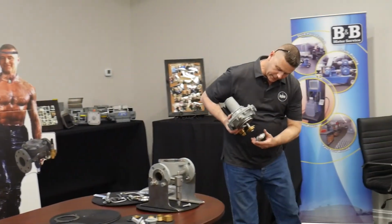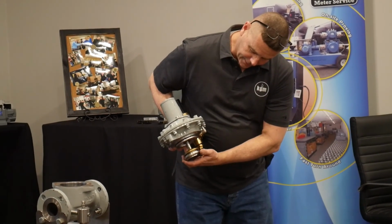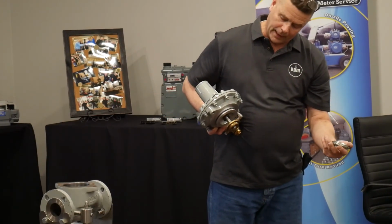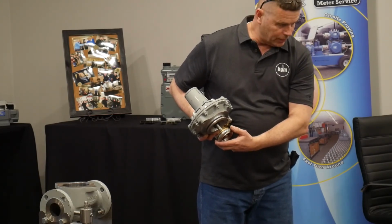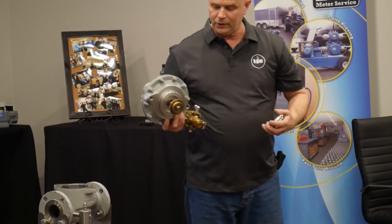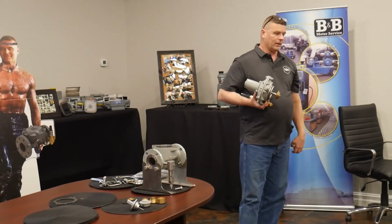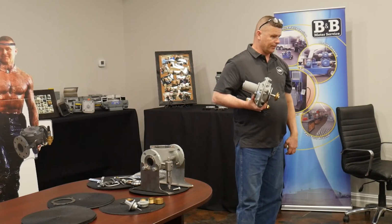Same situation, but instead of it being wide open when it lifts up, for the first quarter inch it's still inside the housing of the orifice, and the gas has to flow around the tight tolerances between the two. Not until it clears it all the way do I get full flow. So I lose about 15% of my top end. The Cg is like 1970, still way more than a large port. And I gain back quite a bit of that low flow rangeability.